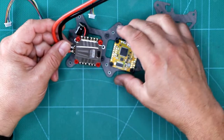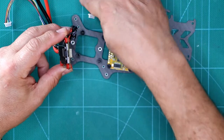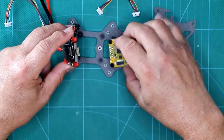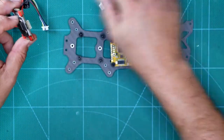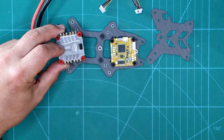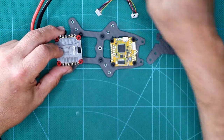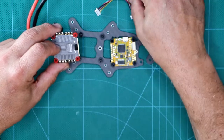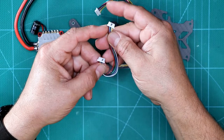The next thing I need to know is I've got to connect the JST connectors — I forget exactly what they're called — we need to connect that to that. I had to make my own harnesses because this is an older model ESC, and I looked at the pinouts on both boards. I also made some notes: F for flight controller and E for ESC.